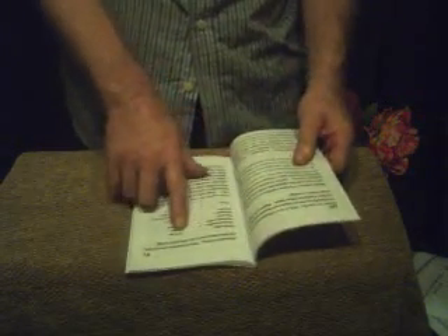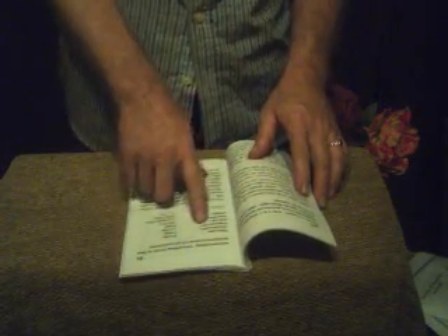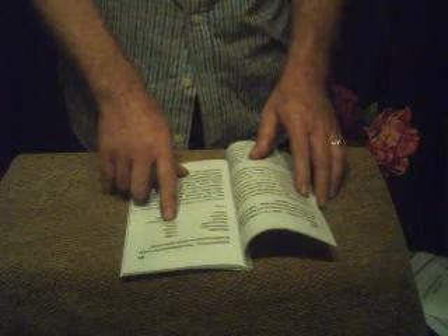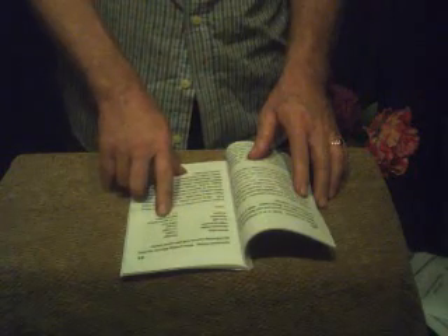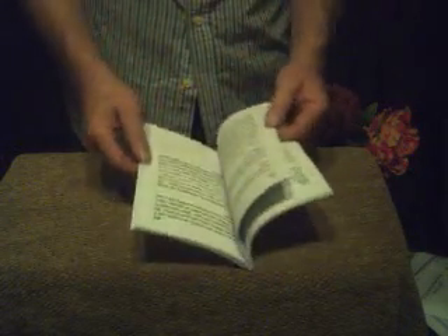There's a specialty formula for plating nickel directly on steel without a preplate of copper. It's on page 21. It shows ammonium sulfate, nickel sulfate, boric acid, the bath temperature, the water temperature — 100 to 103 degrees — amperes at 1/10 ampere per square inch, and instructions on how to accomplish the plating. So you have all you need in this book.